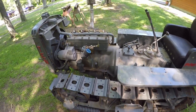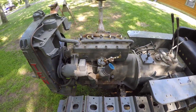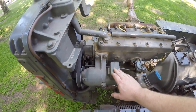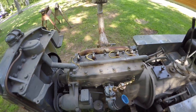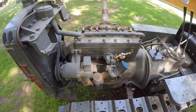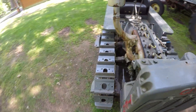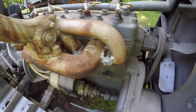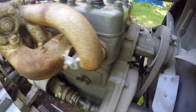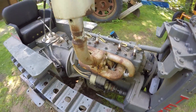It's really starting to open up around the engine. The next three pieces I'm going to remove are kind of elective — they don't really have to come off for this job, but I'm going to take the carburetor off, get the generator off, and remove the manifolds. I want to protect these pieces since they stick out and can get hung on things — a carburetor and generator would be difficult and expensive to replace. I also want to get the manifold off because someone reused the old gasket and there's high-temp orange RTV sticking out everywhere, so I want a new gasket placed under it anyway.